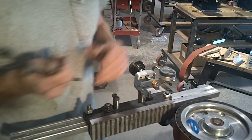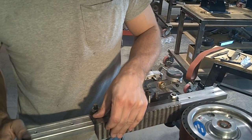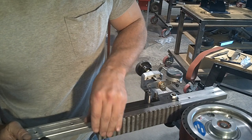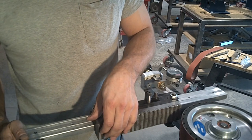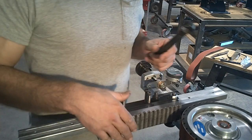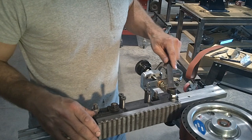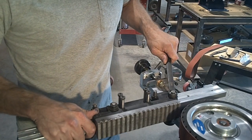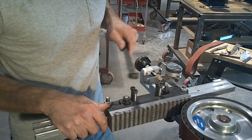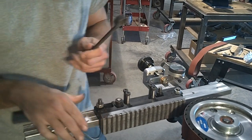is the tapering attachment I'm talking about. It's a built-in tapering attachment. If you're familiar with surface grinding, or with a lot of machining, you know of a sine block or a sine table. A sine table uses basically round stock and point contact on a plate so you can shim accurately.